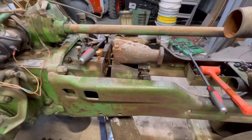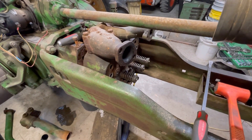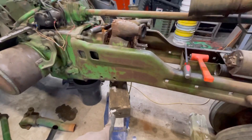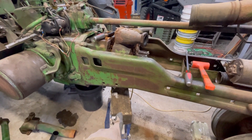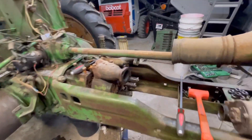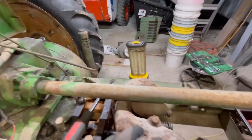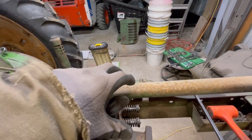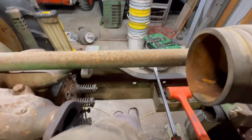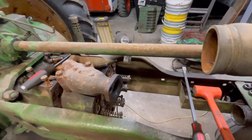I've been kicking around some different ideas to get lower down to the bottom and try to get it out of there. I actually just started the forklift up. I had thought about setting it down on that floor jack and lowering it down that way, however what I may end up doing is backing this tractor down off the concrete so I can come over top of it with the forklift, tie a chain to help steady it, then lower it down and try to get it worked down through that hole between the frame rails.